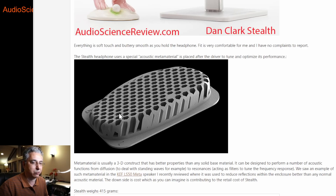What's great about it is that they have incredible flexibility in tuning the sound of the headphone, both in frequency response and in dealing with any acoustic issues in the product. I recently tested the KEF LS50 META, which uses metamaterial the same way — not the exact same application, but they use it to reduce the amplitude of internal reflections. When you have a ported speaker, you can get resonances inside that come out the back of the port like a little crappy speaker. I think they managed to get 10 to 15 dB more improvement than if they used the world's best absorbers. So advanced material and advanced design techniques are wonderful to see come to consumer products.